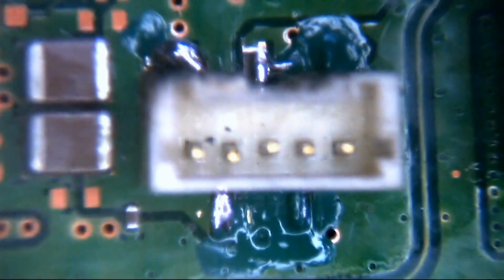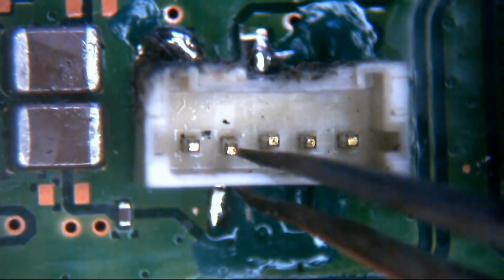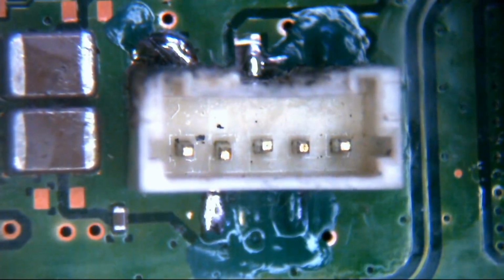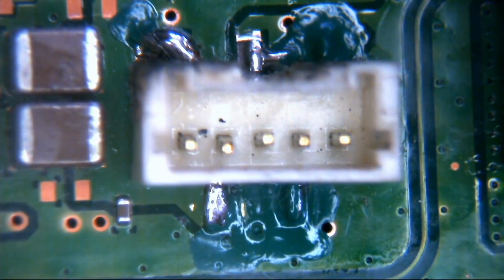But as you can see there now, our 5-pin connector is back in situ. As I say, it's really strong. We can move the board about by doing that, so it ain't coming off anytime soon. It's well anchored in. A few of the pads were still intact anyway, so it's got a good anchoring in there. And like I said, we've rebuilt a couple of new pads and got a nice strong solder joint across two of them, so that's going nowhere. That's not in danger of coming off again, unless you're really cack-handed with it. But that will be absolutely fine and dandy.